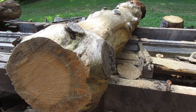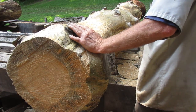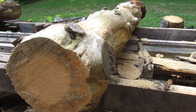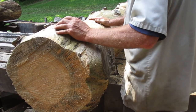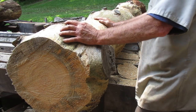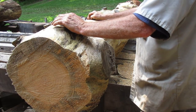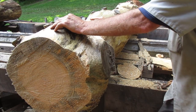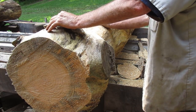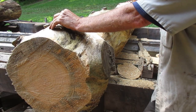See all the bumps, knots, and miscellaneous junk on there? You could saw a nice face on this, then flip it 180, and have one of these knots hanging down — and you're not going to get past the mandrel. What do you do? The easiest thing, that's why they flip it down. Once you have a flat on there, you're good to go. Now, if I had a hydraulic log turner like Mark does up there — he's got a log turner that spins it around like a magic wand — ain't no magic wand here. When you see one spinning around, it's like one guy said: it's Armstrong, and that's all there is to it. He still has to have a flat face, and if he has one hanging down into the mandrel, he's going to have to turn it. It's just that simple.